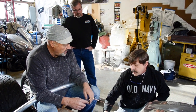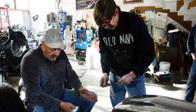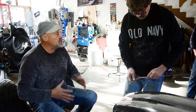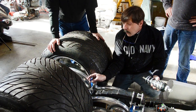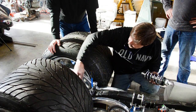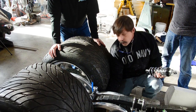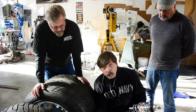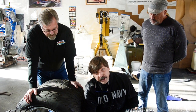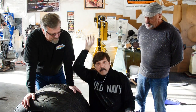The little fuel tank can be down in here - I can make you one that fits right in here, holds more, and lays down. I want it to come in like a motorcycle, like the old racing tank on a motorcycle, with a motorcycle feel and a filler in the middle. The shock absorber is the only thing we have to add, and we've got another really cool way to do that. We're going to extend the top of the shackle up and put an oil-filled shock absorber extending back so it will fill one more space. By the time we put the propeller shaft - or drive shaft as Americans call it - in this thing, it's really a lot of packaging in a very small spot, and it really came out great. If it hadn't been for guys like Ron Kroom doing the beautiful machine work, it never would have got to this point. It's a team effort - the designer, the builder, and the machinist to bring it all together.